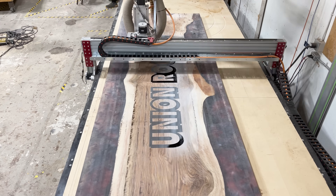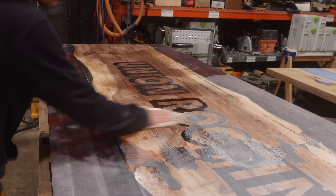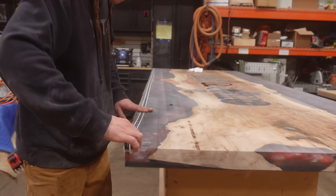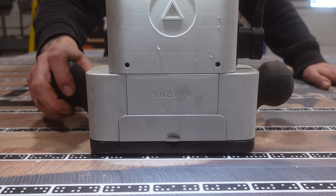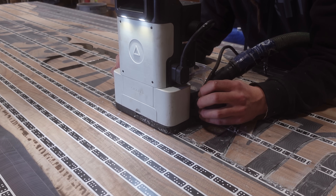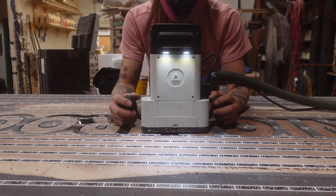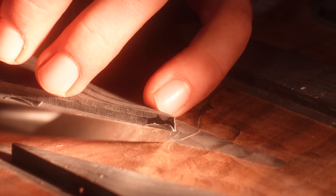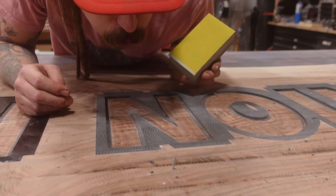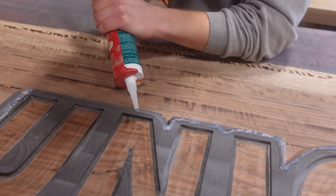After that week has elapsed, we put the piece onto our CNC machine again, flatten off that excess layer of resin, and before we can stick that tape down for the Shaper router, we wipe everything down with alcohol to remove any dust and debris — and it also gives us a sneak peek of what the finished product will look like. The tape you see with little dominoes on it laid down onto the table gives a map for the router to know what it's machining. There's a camera on the back side of the router that reads the design of those dominoes — each domino has a unique pattern — so the router knows where to cut and where not to cut. That's how we achieve this perfect shape without using any jigs.